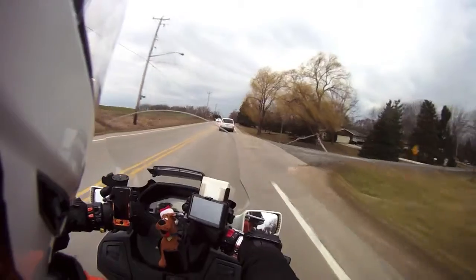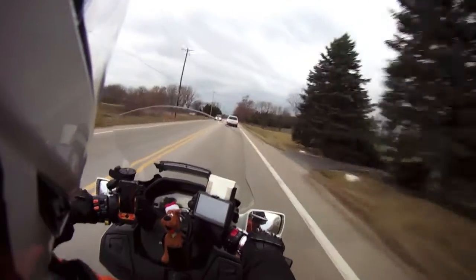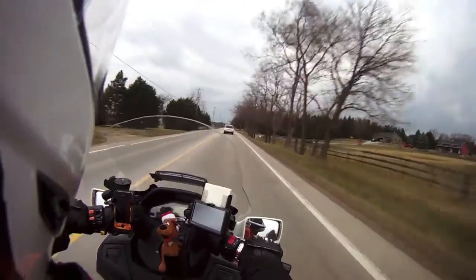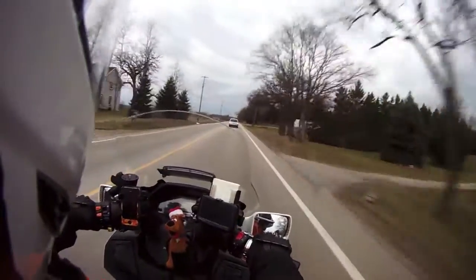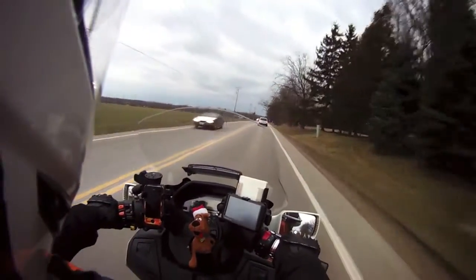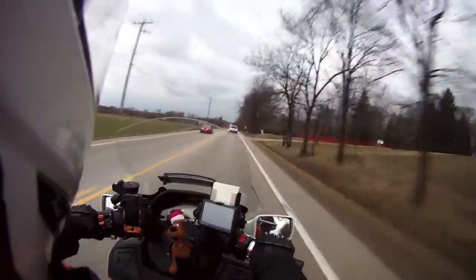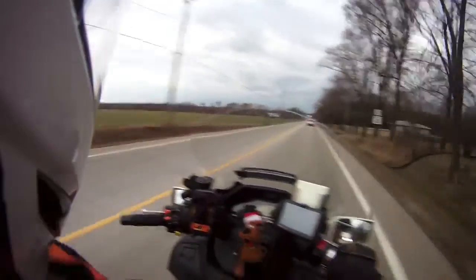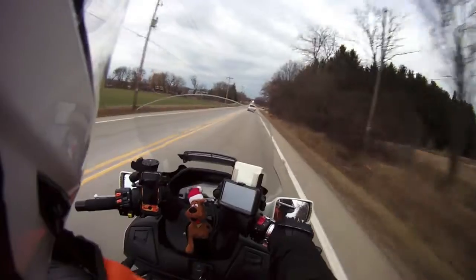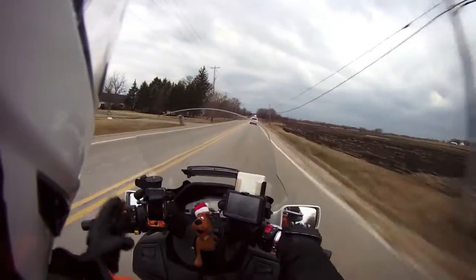I did the standard thing — I walked over to the circuit breaker panel and checked to see if any of the circuit breakers were tripped. Of course, they weren't. So then I headed over to the sump pump, unplugged it, and I had a vacuum cleaner there. I'm not in the water, so I plugged in the vacuum cleaner and it turned on from that outlet. So I unscrewed the pipe, brought the sump pump out of the pit, then plugged it in and manually tripped the little buoy thing, and of course it came on.